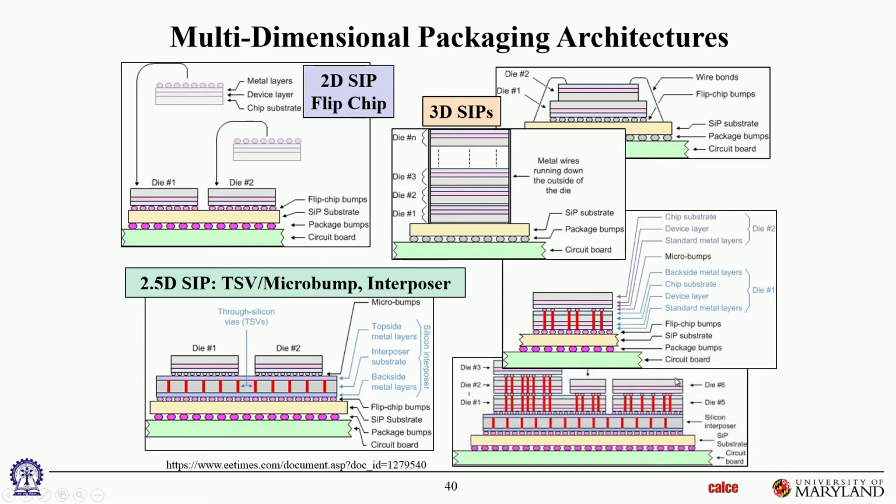So, of course I'm speaking somewhat qualitatively here. The real designs get pretty complex, and there are only some limited examples yet, but the vision is that they'll get more and more complex as time goes on. So the way people are increasing the functionality of components is by this kind of multi-level heterogeneous integration, rather than trying to put a lot more onto a single die itself. So use multiple dies rather than a single die. That's what heterogeneous integration is all about, okay?